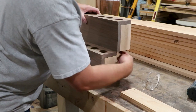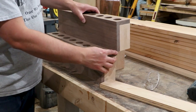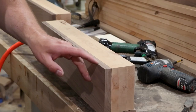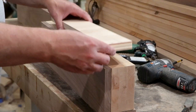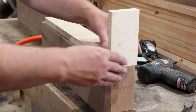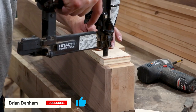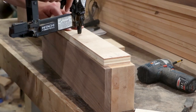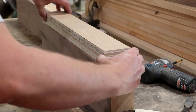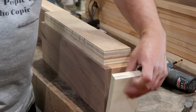So to fill this bottom area up, I'm just going to use some scrap plywood and inset it in a 1/4 inch, so that way it'll clip onto the ledge just like that and sit in the cabinet securely. All right, so I scribed in a line that's 1/4 inch in from the edge, and I wanna make sure I leave at least the thickness of my side piece here. So I'm gonna line up here. And just for some extra blocking, I'm gonna make a little bit extra thick here. All right, and then these guys are the same height.